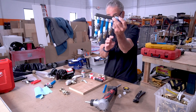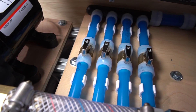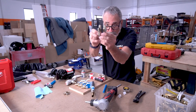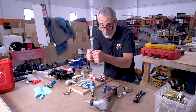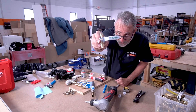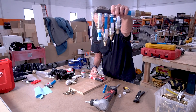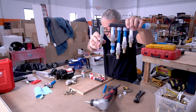My shutoff valves — typically in the past I've been able to use these little guys from Uponor. What was nice about these is they were compact, very compact. You could line them up side by side real nice and close. They stopped making them — I suspect because at some point the handle gets very hard to open and close. So what they offer now is this, which gets a bit cumbersome. What I had to do is cut them down, pull the sleeves off, cut them down to the point I needed them.